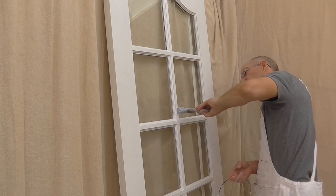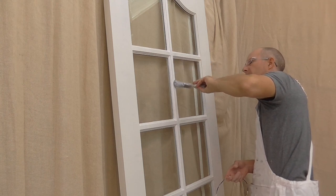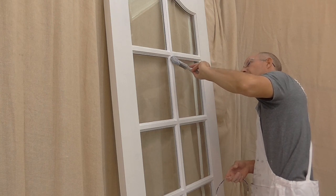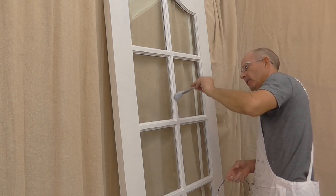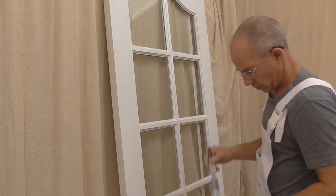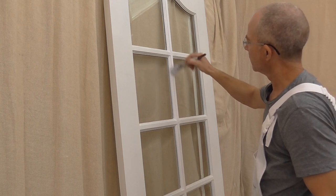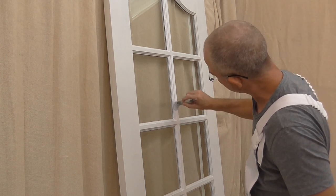It's never easy doing a door that has been stained and then you're asked to do it white. It's an absolute nightmare, to be honest. Just to get the right level of opacity on it is just hard. Sharp edges on the wood and things, you keep scrubbing the paint off, so it may look as though I'm painting slowly, but I'm actually trying to get the correct level of paint on it all so it looks right when it's dry. You know, I could try and rush it, but then it wouldn't look as good.